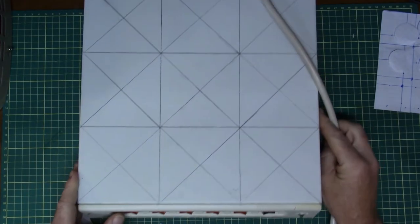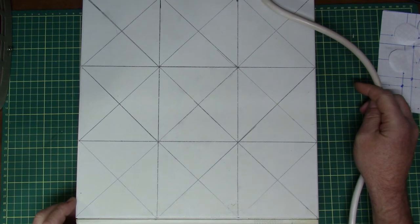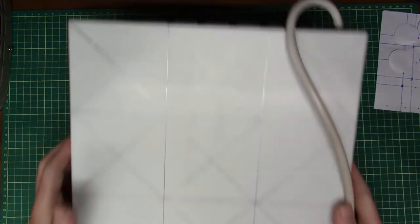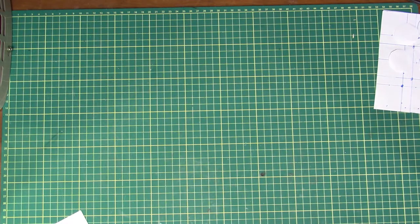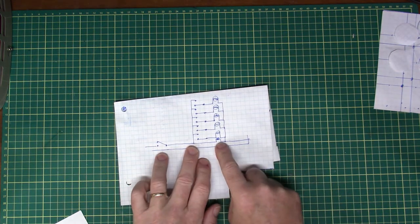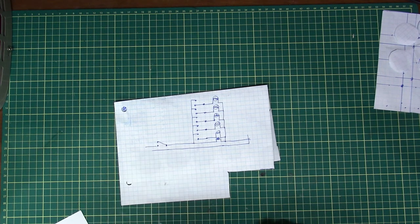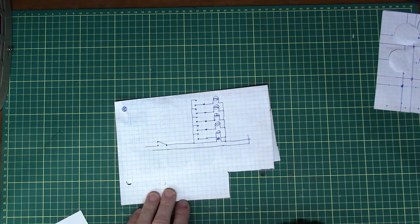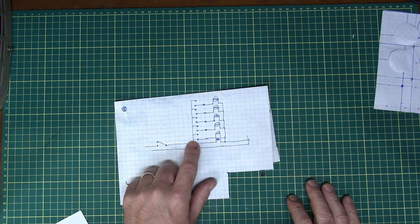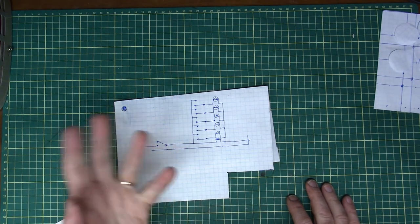I got my box and penciled in all the drawings — one, two, three, four, five, six — with plenty of space up front. My schematic, which I also sketched out at the same time, is very simple: the main switch comes in, one line goes straight to the first bulb, then I go up the line switching bulbs as I need, and it goes back out. I did go out and price building one of these from scratch. The switches run about six to twelve dollars each, so for a five or six switch unit you're talking thirty to fifty dollars just for the switches.